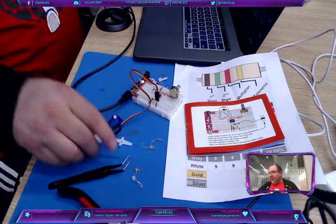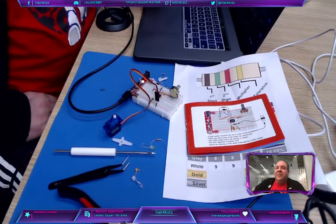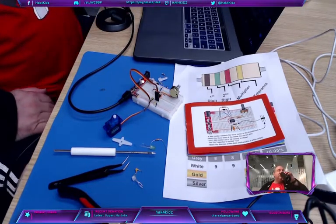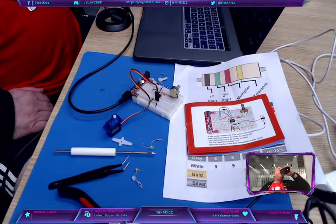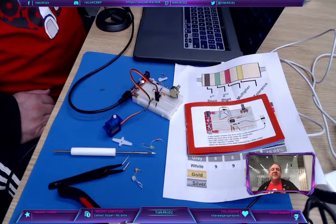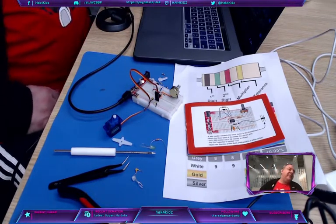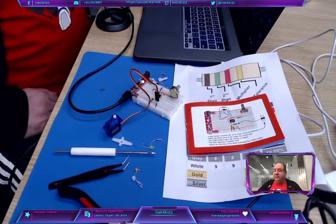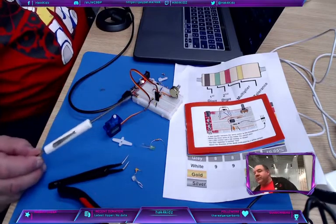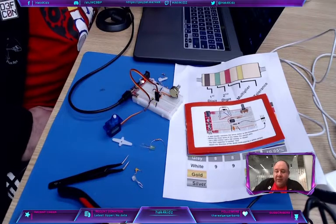But you got your servo. Yeah, you can just sit there and fidget all day, twisting your potentiometer and making it work. Is it working? I saw a face. You feel a buzz? Put it down at 3.3 volts because sometimes the 5 is too high. It might be too much power. And then turn it. Is it working? Loosen up your screw. Here's another one. You shouldn't throw screwdrivers, kids. It's dangerous. Meanwhile, I just threw a screwdriver.